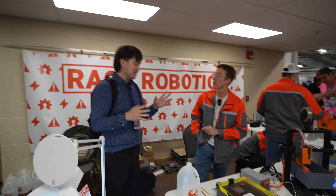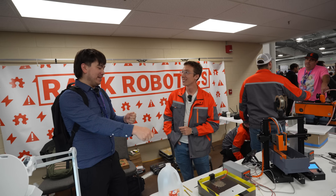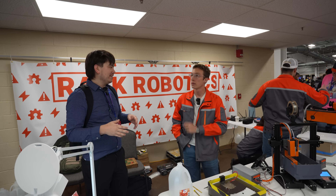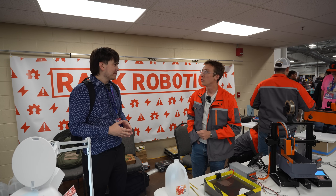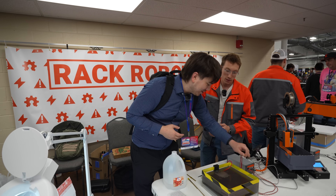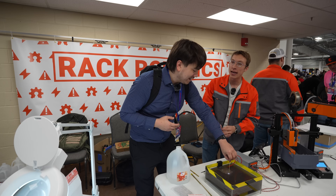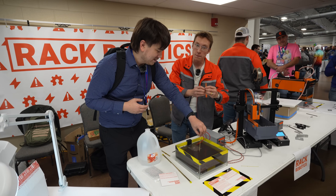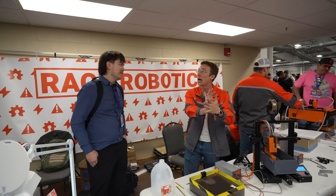I just want to make sure I understand the technology. How come when you take the high voltage and put it across — when you touch it — how come it just doesn't cause a short circuit and blow everything up? That's because we're not touching it. It's non-contact — the electrodes only get very close together. I can touch it. Oh, you see? And that's when we short it out. You hear that kind of whining and it stops machining. But right now you're not actually touching it. The vaporization — basically the water and metal exploding in that spot — is pushing the brass rod away.